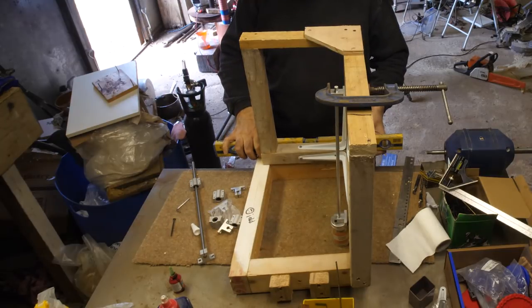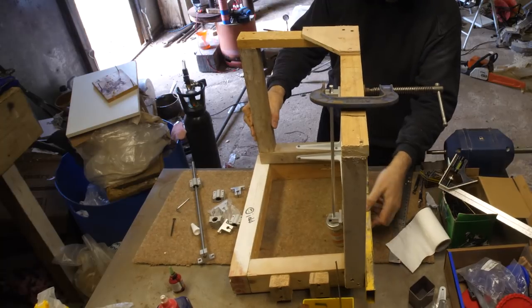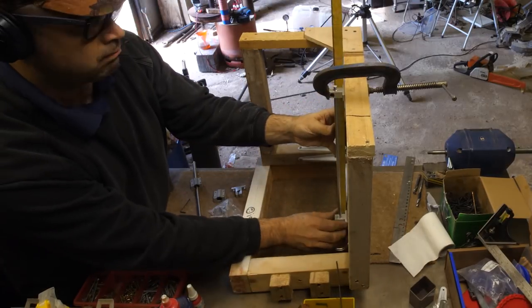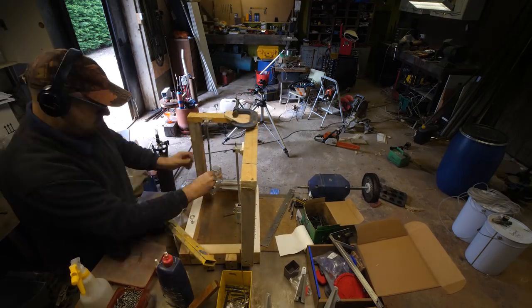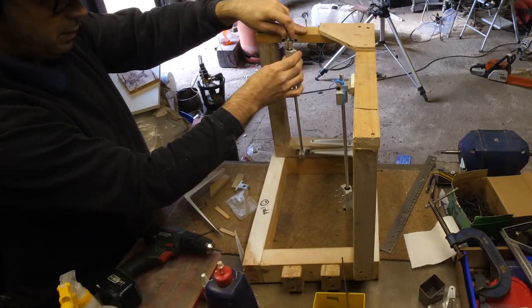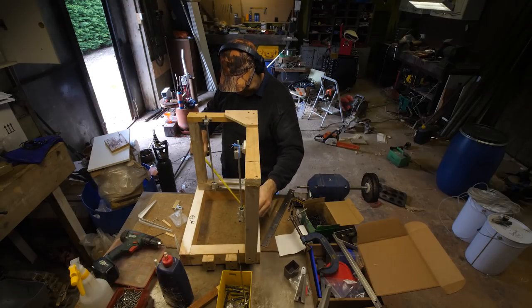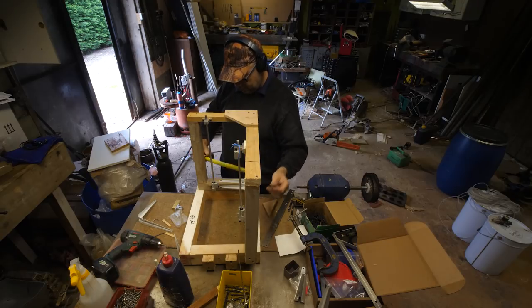As I fix the rods to the frame, I take great care to make sure each one is mounted vertically, using packing or spacers if needed. This will also mean that they're parallel to each other. Once they're both attached, I fix a wooden beam between a linear bearing from each rod. Enough to reach from there to there. 30 centimetres would do it.